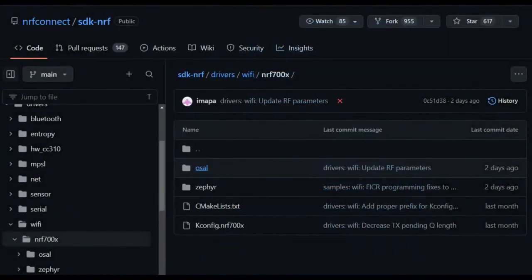They do have code available through the SDK, which is really good. There's Zephyr — that's an RTOS, it's very popular, and I do recommend it. There's an example where somebody got the Zephyr version working with step-by-step instructions on how to do it. There's also OSAL — that's an operating system abstraction interfacing layer — so you could port this to other platforms. But so far most people have been using Zephyr within the NRF SDK.